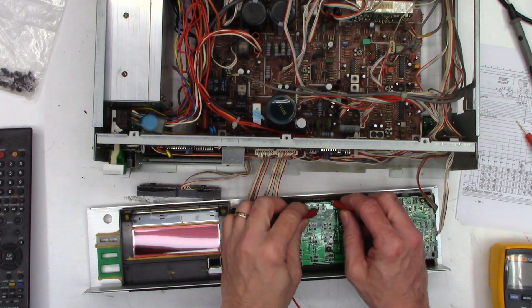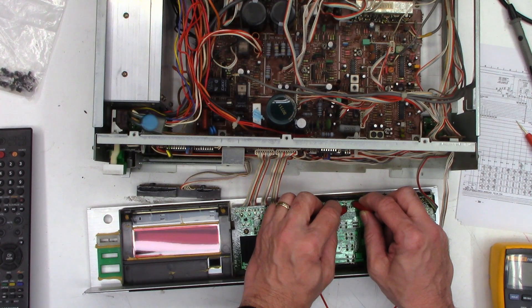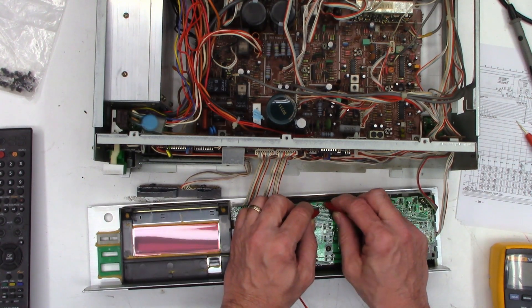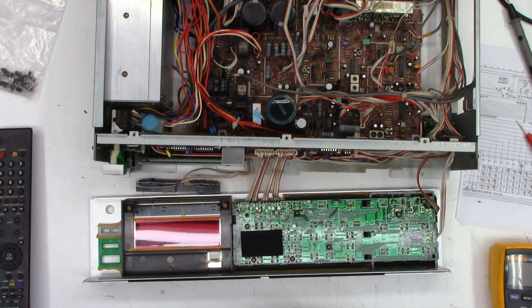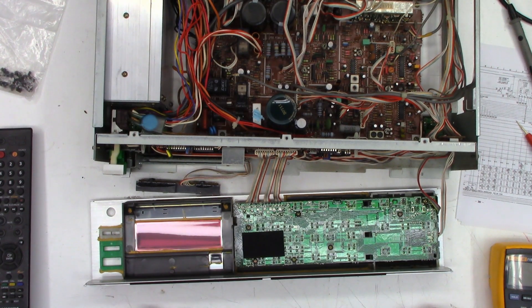You will not believe this. I thought I'd just go ahead and try to jump around. I checked the voltages — everything's great. It works perfect. Does the balance work? I think it's all the way on one channel right now. Sure enough, it just simply needs a set of switches. Almost every switch on this board is bad. I'm going to go ahead and get a bunch of these ordered, and we'll change them all out — hopefully this thing will be good as new once again.